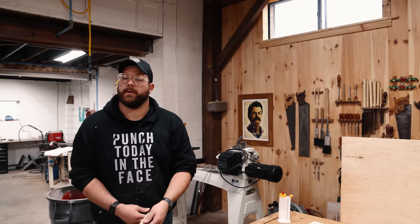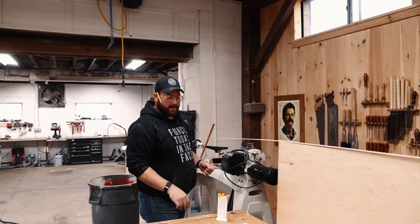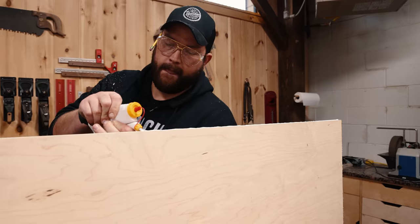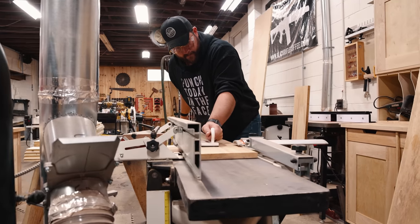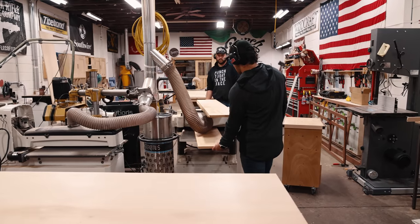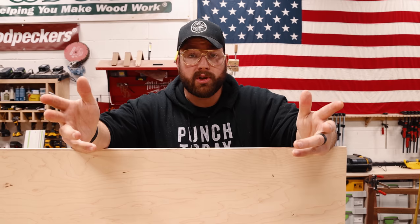What you just watched was me mill out some hardwood edge banding. And now we're going to slap that down on top with some speed set — this is like a 20-minute drying glue or something — and do all the parts before we start cutting joinery and assembling. The edge banding has dried up, took 30 minutes — we were feeling kind, gave it a little more time. So now we're going to put this carcass together using a combination of pin nails, face screws, and pocket holes. Should go together pretty quick.